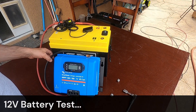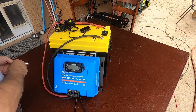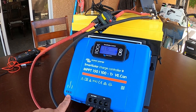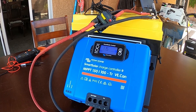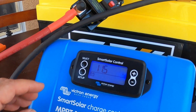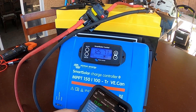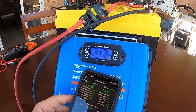Now that we have everything connected to our charge controller, we can connect our battery cables to the battery. This is an auto-sensing controller, so it should automatically detect that we're using a 12 volt battery. Self-test lights — all good. So it came up with 11.5 volts and it's flashing 12 volts — it's detected a 12 volt battery. We'll go ahead and hit select. The battery BMS is complaining because we're pushing too many amps — about 75 amps. So it's going to throw an over-current protection error. We need to configure this charge controller to chill out a little bit.